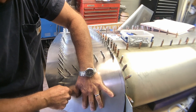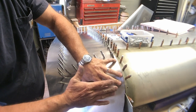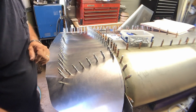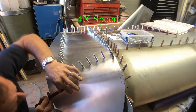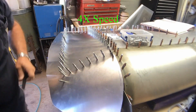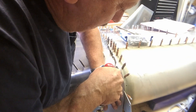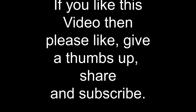I'm going to keep this line going with this nose rib because then this will fall in place and we can trim this back to fit if we have to. But if we just start riveting here, there's always a chance that it's going to pop it out a little bit more at the bottom and we won't be able to get a good tight fit. I like that. Now I'm going to roll the wing over and we will finish fitting this skin in part two.